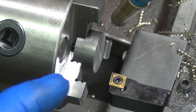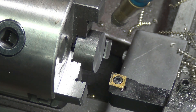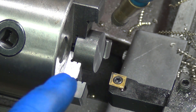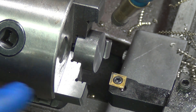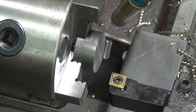When I started running and programming these parts for what you just saw, it was taking a good 45 seconds or so. I trimmed it down — I was starting out at like 3 to 4 inches per minute, got it up to four, and it was running at 38 seconds. Now it's running at 15 seconds for the back side. The front side runs the same if not a little faster, but the timer keeps counting until you hit start again, so it's hard to tell exactly where it shuts off.